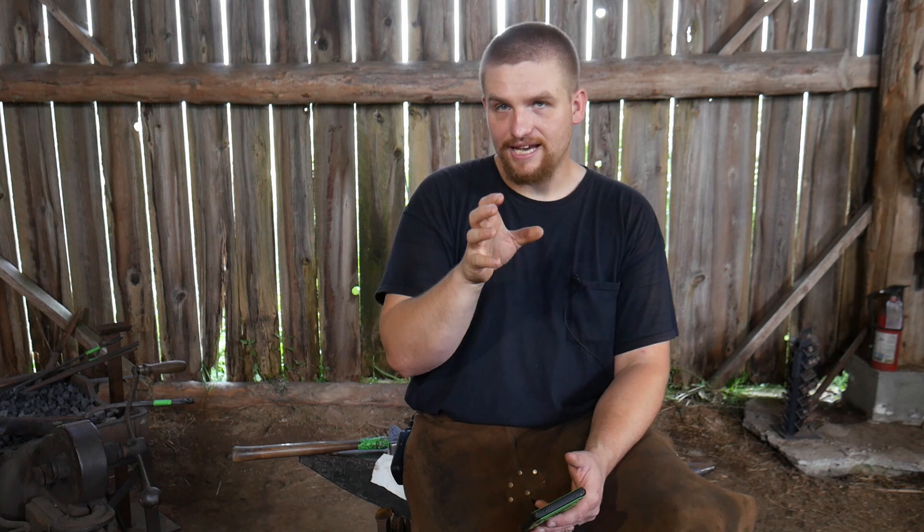Three pound hammer — it may be a bit too heavy for you, causing you to slow down your hammer strikes versus getting that nice velocity and whip with a quicker pop. Say you have a half-inch square stock and you're hammering with a three pound hammer, but because of the weight you're swinging it a little slower. That stock cools very fast under the hammer and you have to take more and more heats to get the same work done. With a lighter hammer you could get an extra third more blows per forging heat and progress across the work a lot quicker.